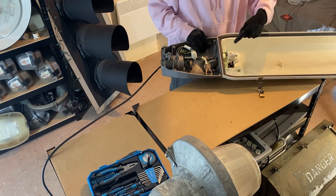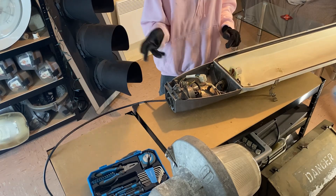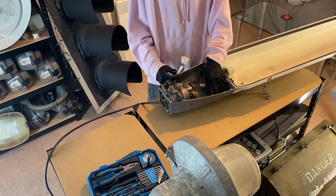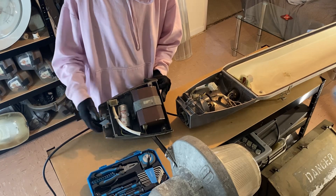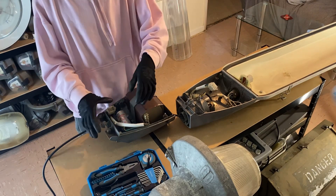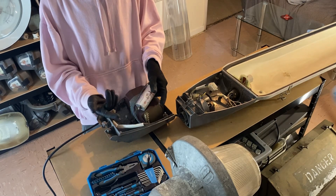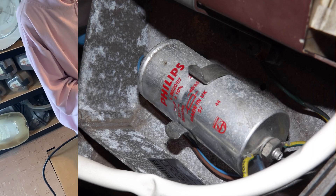In this section you can see the four bolts that you would use to take the shoe off. All of those do move because I have taken the shoe off before when I cleaned the lantern up and got all the cobwebs and bits of dirt out of it. Very simple layout inside - you've got your mains which comes into this connector here, then you've got your live which goes to your photocell. Live comes out of the photocell and comes up here to connect to the gear. You've got your leak transformer there and your capacitor there. This leak transformer isn't really held in by screws, it's just got this metal band going over it which keeps it held in. The capacitor has got a simple toggle mechanism to pull it out. There is 87 and then 44 on the capacitor which I think refers to the 44th week of 1987. It's a Philips L5020/07 capacitor, 30 microfarad.